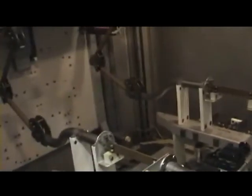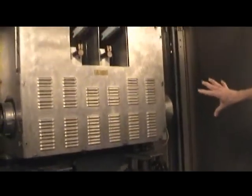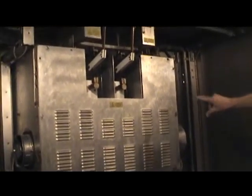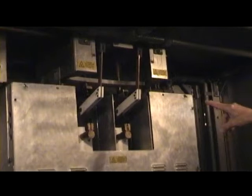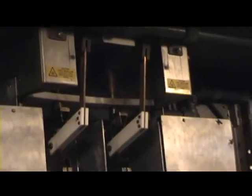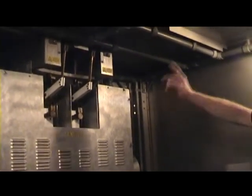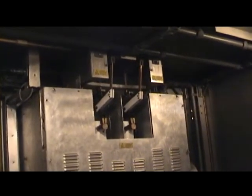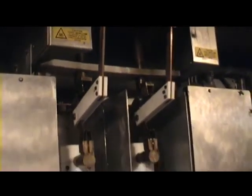The RF whizzes up through the arms and through the coils and capacitors inside this filter, which cuts any spurious signals above 30 megahertz. It ends up on the two connections at the back, which are currently earthed down so we can work in here safely without picking up from other antennas while other senders are radiating. When the doors are shut and locked, the connections become complete. The actual 320-ohm balanced feeder output at the top takes the power down the field in a balanced system. That's a 250 kilowatt output RF stage — let's go look at the modulator now.